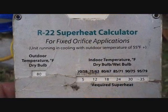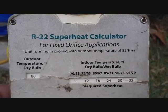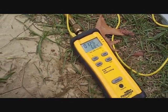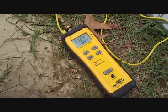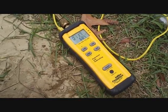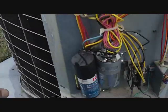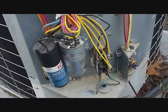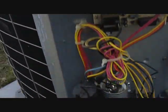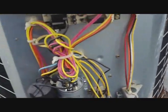Hook up the superheat. At 80 degrees outside and about 76 or 77 probably still inside, we have 13 or 14 degrees superheat — that's what we're looking for. We've been coming down steadily; if it keeps falling, I'm going to think there's something wrong with that evaporator inside as far as being dirty. Pressure's not coming down though. It ended up with a superheat around 8, which was within about 5 of our design of 12 with the indoor air temperature. A little overcharged, but close enough where we're not going to bother with this one being as old as it is. Plus or minus 5 is acceptable, so we accept 8 as our design superheat. We are finished.